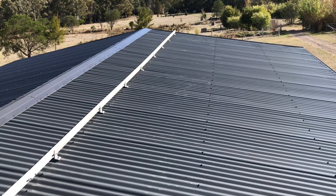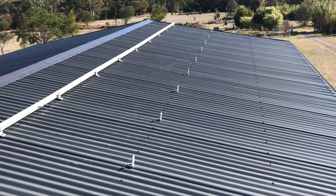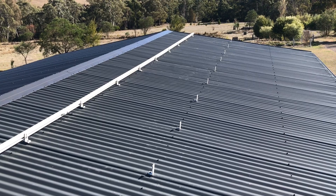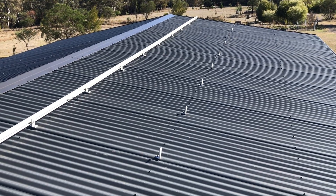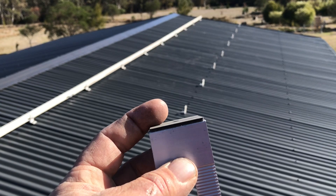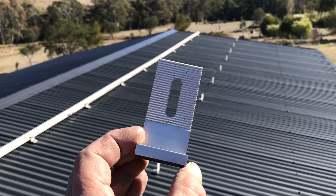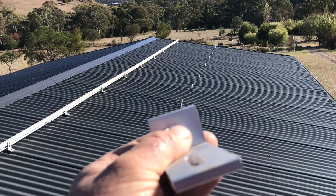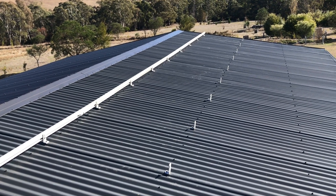As you can see I've got all the feet now set up, all about a meter apart. When looking at these feet, they have you swap in longer screws to hold the feet down. On the bottom of the feet themselves there's a rubber gasket that seals off into the tin. You can attach the rails onto that and adjust them to get the rails nice and level. The big screw just sits through that hole there and attaches back onto your batten.